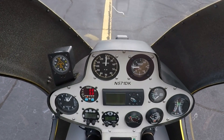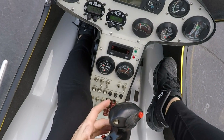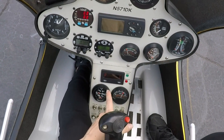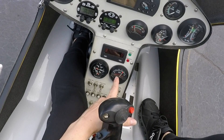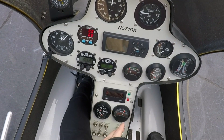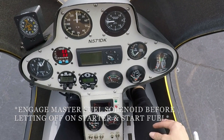It's just kind of tricky because I've never seen a helicopter started like this before. The buttons down here underneath my right leg are the start and the start fuel. We're going to first hit the start button, get to about 10,000 RPM on the digital gauge, then swap over to the start fuel, which is the ignition, and get back on the starter afterwards. Then we'll gradually let off from the start and the start fuel, engage the master fuel solenoid, and the engine will be self-sustaining after that.